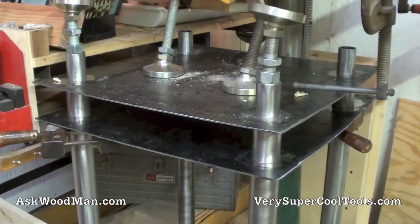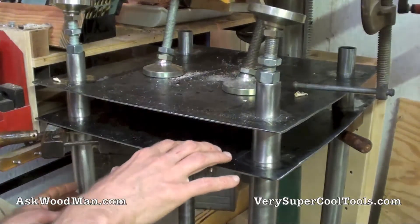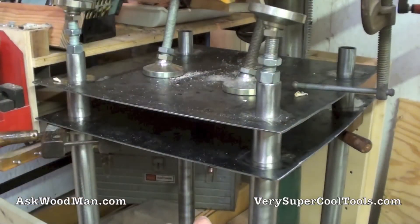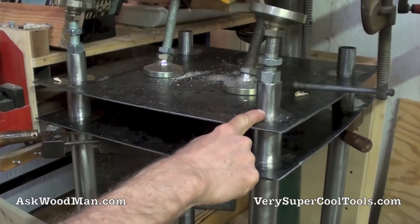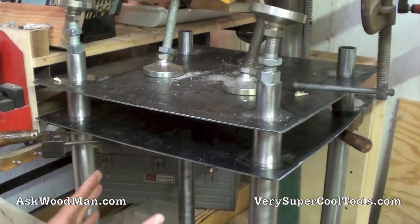At first I thought I'd put some pins through here for these to sit on, but I was worried I couldn't get all 4 of them sitting down absolutely perfect and didn't want to create a rack. So I am going to weld the nuts on — 2 nuts about here and here. As the piece sleeves up I'll just be able to lock down these grade 8 bolts. I'm going to grind some points onto them so the grade 8 bolt will come through and eat into this pipe.